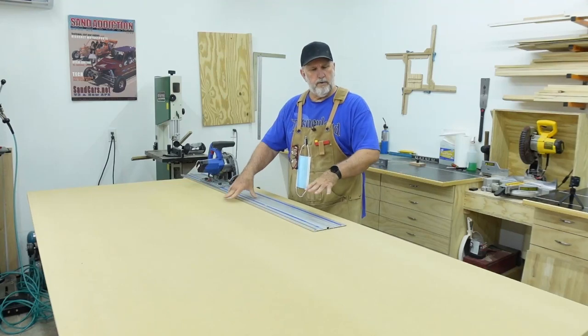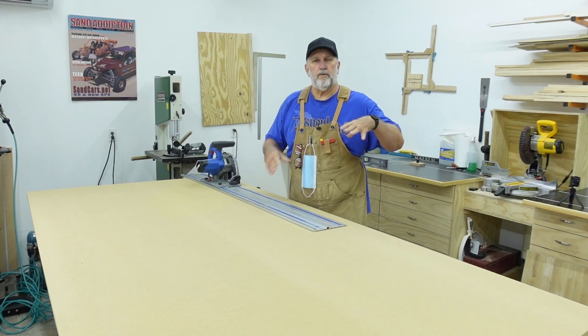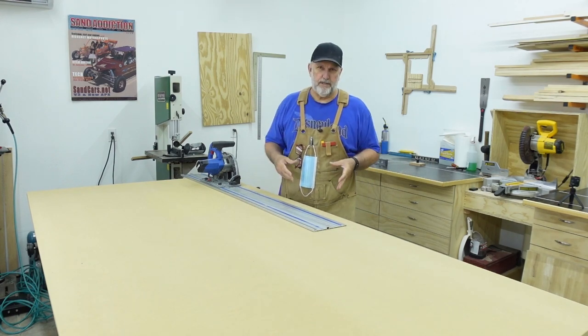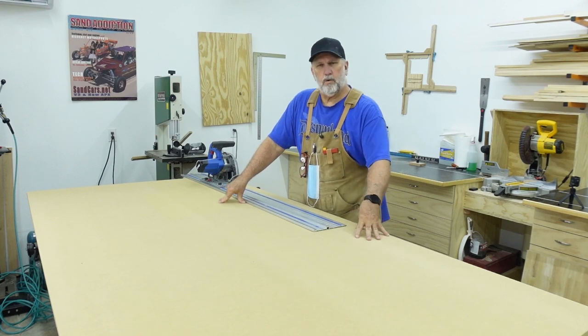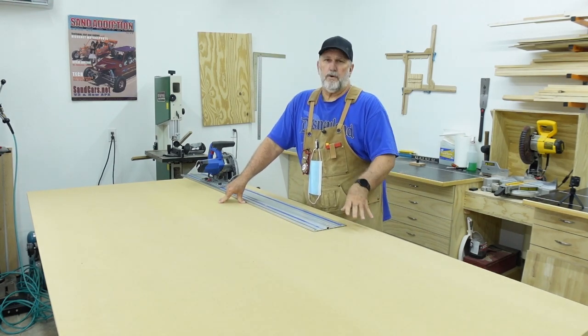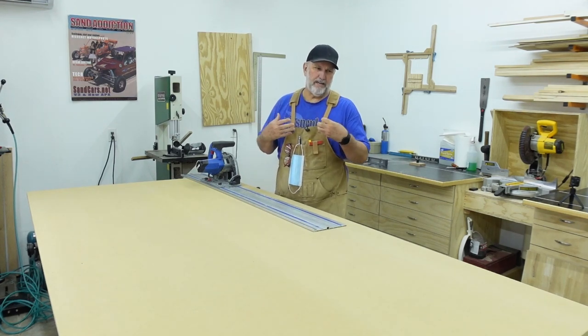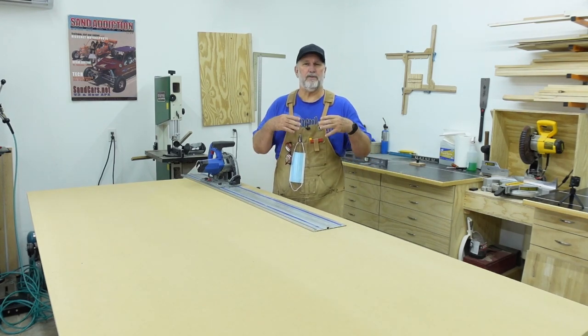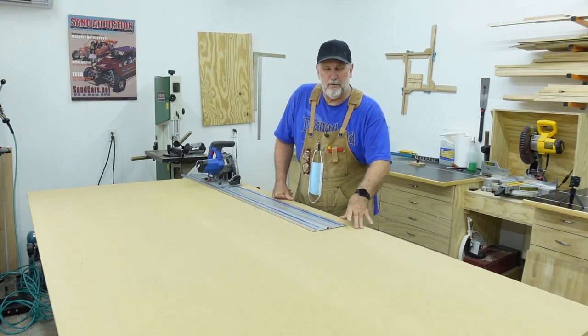So what we're going to go ahead and do is use this MDF. It's a 3/4 inch for the rails and stiles on the shaker doors and drawers. Now we're going to go ahead and use this because it holds paint well. It will work just fine. And it's actually kind of nice because if it dents or any of that, you can actually Bondo this stuff. Easy to fix for a rental house too.